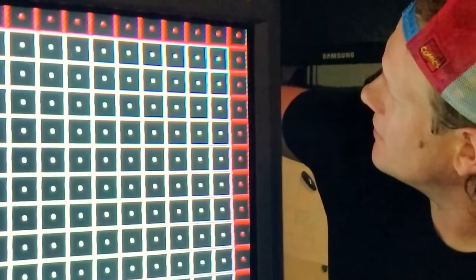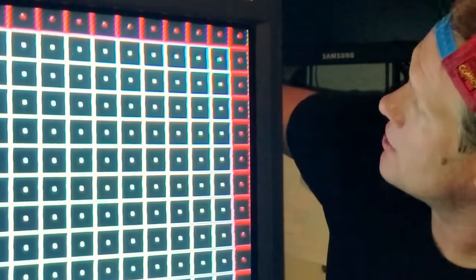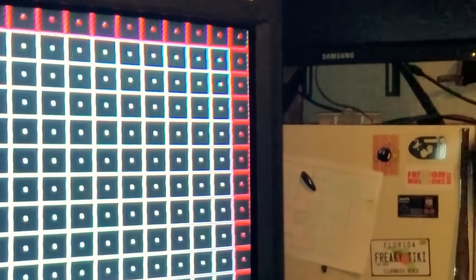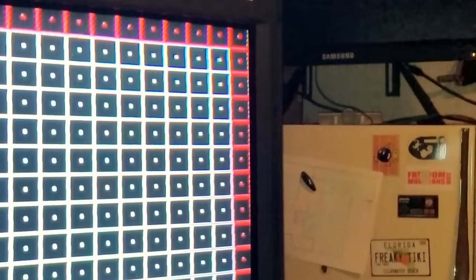You can see how on these older televisions you have to use magnets because they don't have any kind of menu or even potentiometers to adjust certain things. I hope you can see how it's kind of gotten it cleared up. Let's look at the back quickly - you can see how I've reseated that magnet, it's pretty close to the original spot but it did have to be moved a little bit. I'll do more calibration adjustments in a future video on this TV.